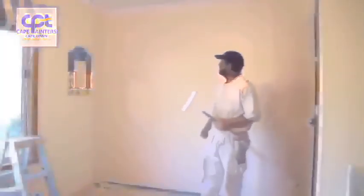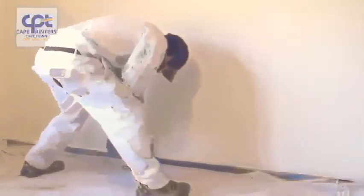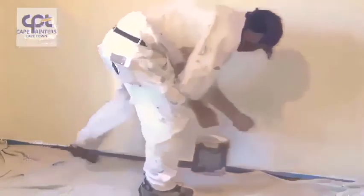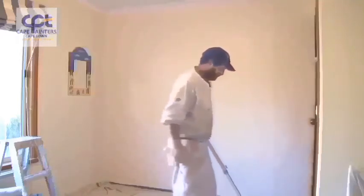Here's a demo on how to roll a wall. Whenever you're rolling or painting walls, one of the first things you want to do is to cut it in and then roll. It's okay for first coats or primer coats to roll first, but with final coats you must always cut it in and then roll. Okay, so now we'll start our rolling.